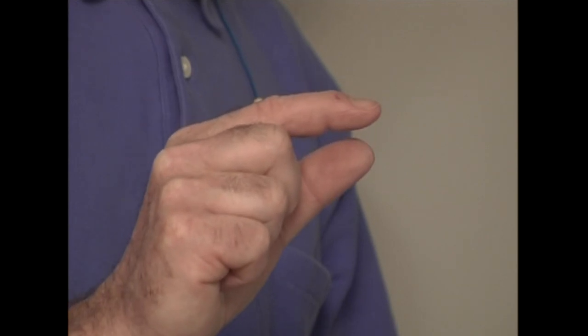The reason for the chalk line is simple. On most jobs, you have to cheat the crown molding up and down to follow bows and bellies in the walls and ceilings. If you don't have a chalk line or some marks as a reference, you can't tell how much you're cheating. You can cheat crown about a quarter to three-eighths of an inch, but if you push it up or down more than that, it might be visible to someone standing on the floor, especially if the ceiling height is low. While I'm snapping chalk lines, I also make a cut list.